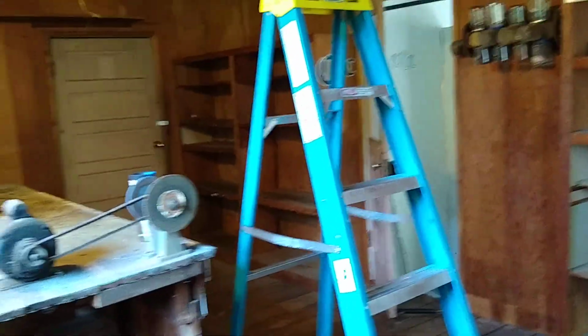And so this is the next step is going to be the blower. I've got the leaf blower. Basically, I've hooked up a nozzle so it's a little more pointed, and this will blast the dust out of the rafters and out of the nooks and crannies. And so we can get most of the dust out. That results in less mud when you're pressure washing.